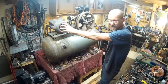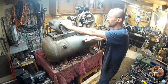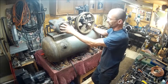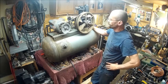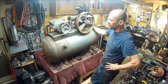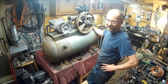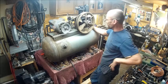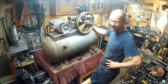We were going to use a half horsepower motor, but this compressor came with this tank, so we've upped from half horsepower to one and a half horsepower. It's 220 or 110 as well, so if I ever want to change it, I can. We're going to have it hold 150 PSI, which I've already set.